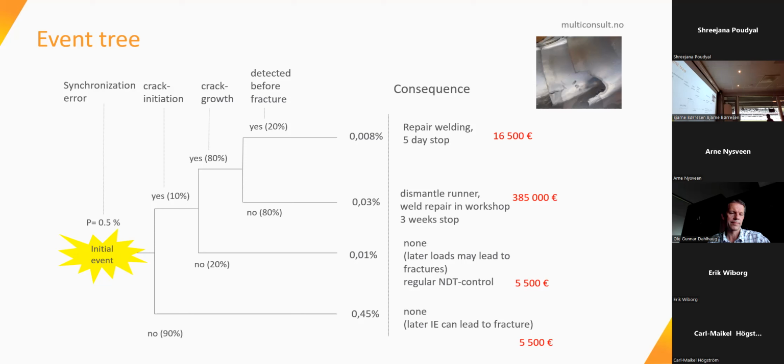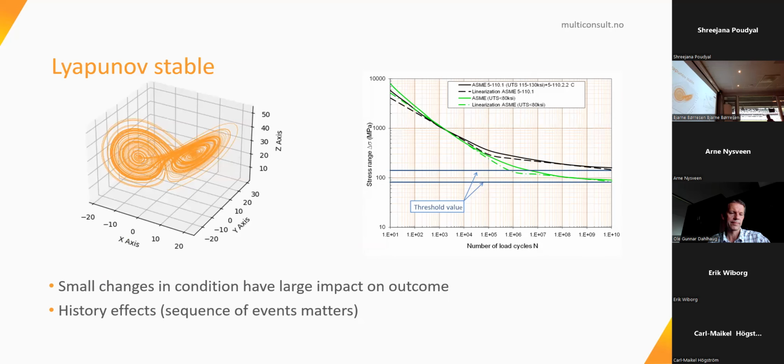On these other power plants back in 2001, Statkraft did some investigation, and they found that they were using these units with so-called AGC, automatic generator control, which was trying to follow the way the power market works, where you are bidding for a certain hour. In the switching of hours, it would sometimes force the units outside the normal operating range. In a case running for 3 months, they had something like 2.5 minutes where the unit was running at 5% overload. And they had some very short time, I don't recall exactly the amount, where it was running all the way up to about 110% overload.